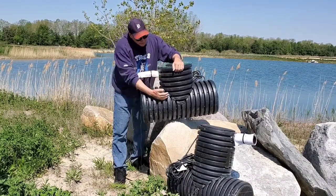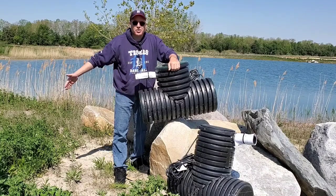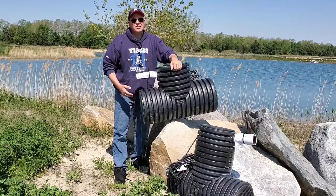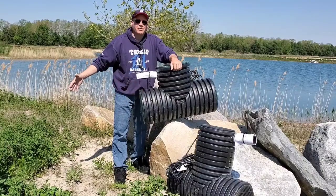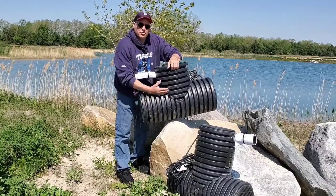Instead of just having a vertical shaft, it has this big horizontal shaft that contains all the water. Now, I always recommend add more chamber length. This is how we ship them out, but you can easily take the end plate off with a T25 nut driver and go ahead and put added chamber length. I recommend it, at least 3 feet. The more chamber you have, the more water it takes to turn the sump pump on.